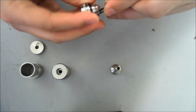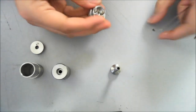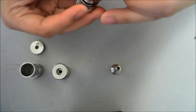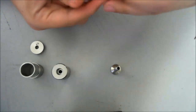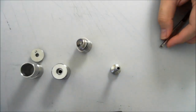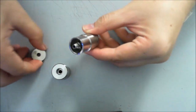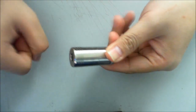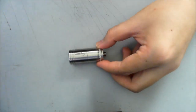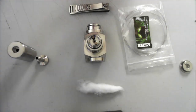The screws always start getting tricky when the camera's on. Alright, we've got one in, then we'll get the other in. This is pretty much a fully assembled bottom deck. The only things left are to put on the chimney, put on the tank, put on the tank cover, and turn on the top cap — then it's fully assembled. But what good is a fully assembled Fogger if there's no coil inside? So the next thing we're going to do is build a coil.